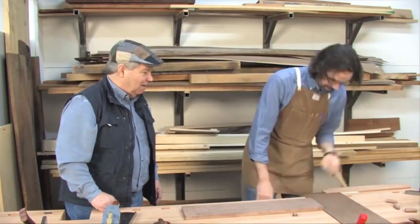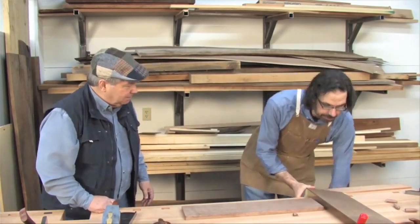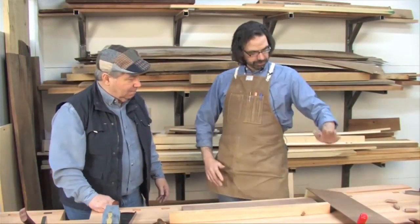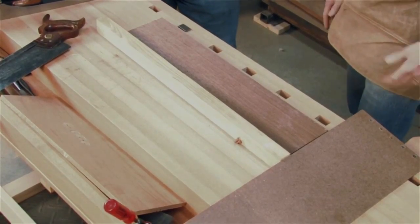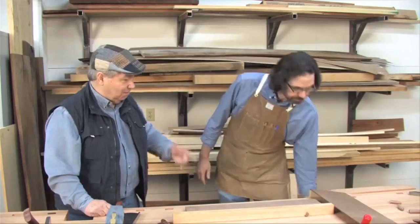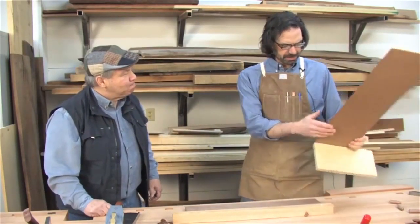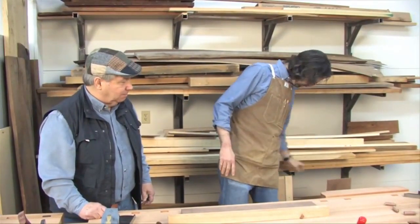You can also rotate it up a little bit and plane thick stock — you can get it up almost six inches off the bench with only two pieces of wood, and you pretty much don't have to use a tail vise. That's my jig I use all the time. That's my planing jig, and it handles the faces of the boards.